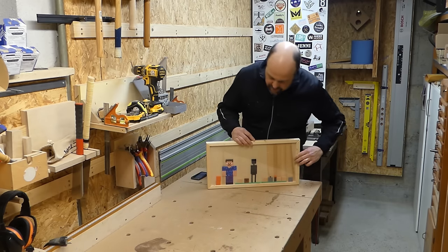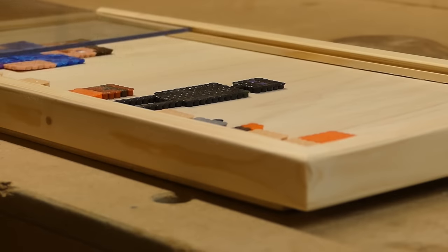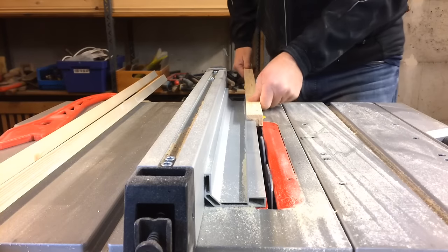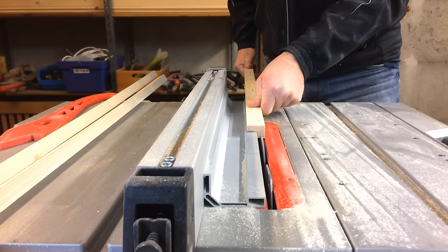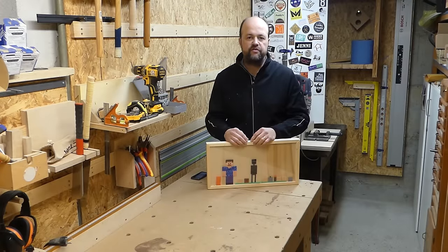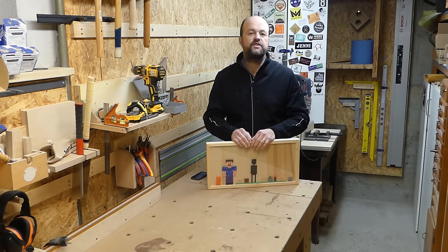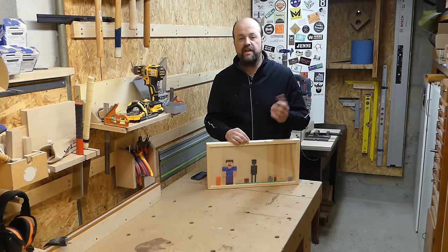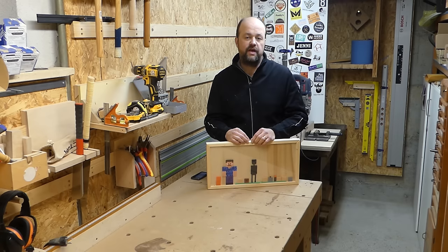The same thing with this small groove that this plane runs in. I cut out the rabbet first and then cut the groove, but of course again, while the rabbet was not in the pieces yet, it would have been much easier to cut that groove because then these work pieces wouldn't have been so shaky on the table saw. So for me, the learning experience was think a lot more before you cut. Or basically, as probably everybody knows except me, think twice, cut once.